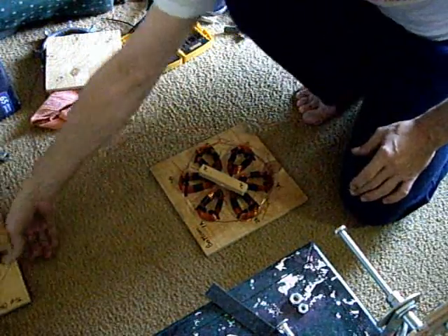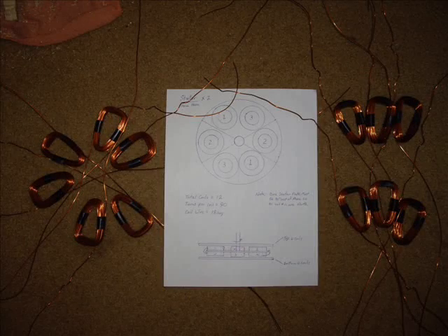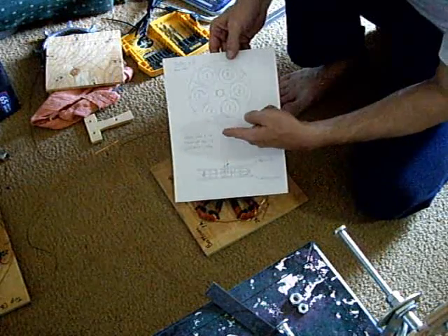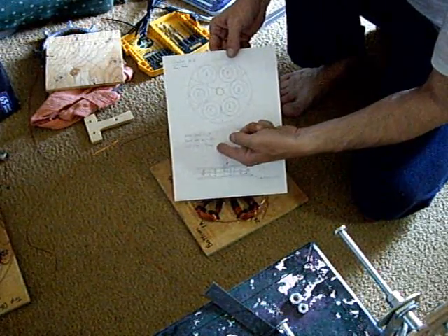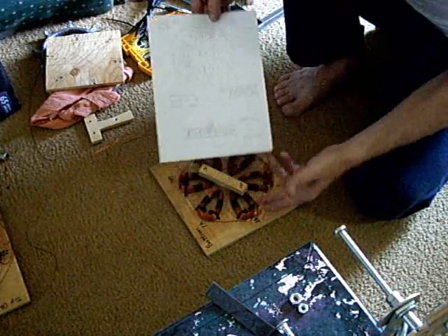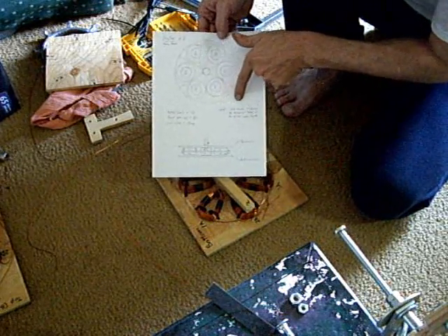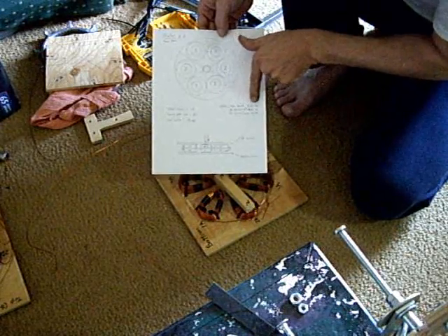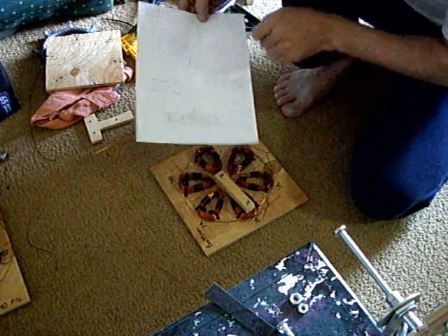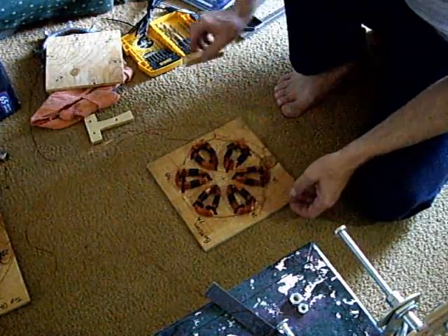You will still be wiring everything in the same direction. It's going to be a total of 12 coils, they're 80 turns each, 18 gauge wire. So the basic layout is: although I've made my coils not round but a little different shape, that's up to you. Understand that the stator plate - one stator plate must be 90 degrees out of phase, so all coil number 1s are north at the same time. That's the important part. Once we have that, everything else will be easy.